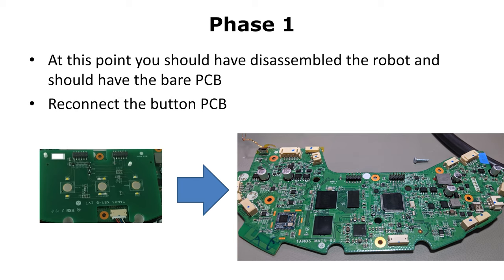So in this step we connect to the robot. First, we need to connect the battery to the PCB — there's only one way to connect it, so you shouldn't be able to do it wrong. Then we connect a serial adapter to the PCB. As mentioned before, you can use a micro-USB cable to get ground. Connect TX and RX. Do not connect the red cable, which is 5V — this is very important. As a first test that you did everything correctly, just press the power button for a short time, less than one second. It's the middle button on the PCB. If you do that, you should see some text output.